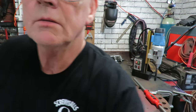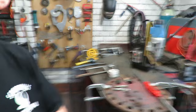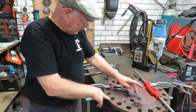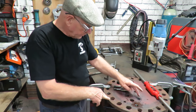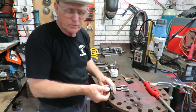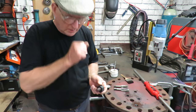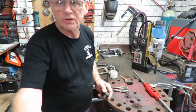Let's have a look — okay, we can see that now. That's the flange. These are the four bolt holes that needed to be replaced. These were three-quarter inch bolts and I've gone up to seven-eighths Whitworth. Most of this locomotive stuff that was built up to the eighties, either in England or in Australia, were Whitworth — quite often that's the case.